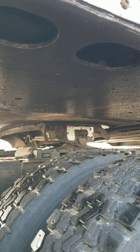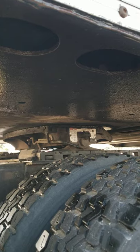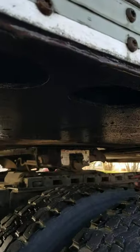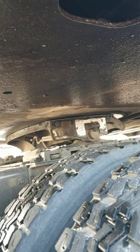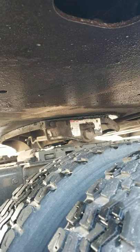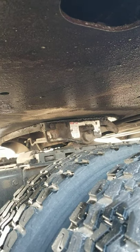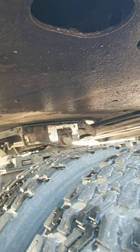Locked around the kingpin and the shank, you have the locking jaws. The locking jaws, not bent, broke, or cracked, not missing any nuts, bolts, or screws. It's properly mounted and secure. This is our fifth wheel skid plate. Fifth wheel skid plate should be properly greased. They're not missing any nuts, bolts, or screws, not bent, broke, or cracked. And there shouldn't be no gap between the apron and the fifth wheel skid plate.